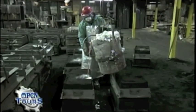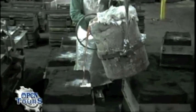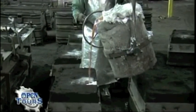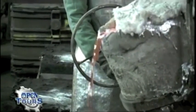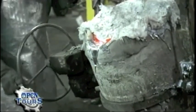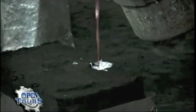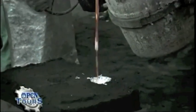It's beginning to pour — pouring into the gate. As that fills up, you'll see the liquid metal rise to the top and puddle a little bit in some of the risers. Those risers are made to keep the metal from having any shrinkage or contraction. You can see it starting to puddle in the center of the mold. Aluminum cools rather quickly, so in a few minutes we're going to dump some of these molds and you'll see the raw castings right out of the sand.